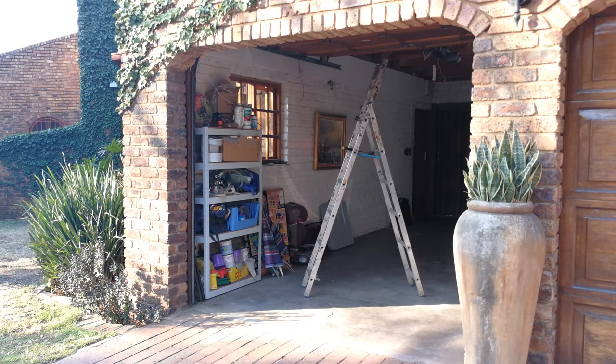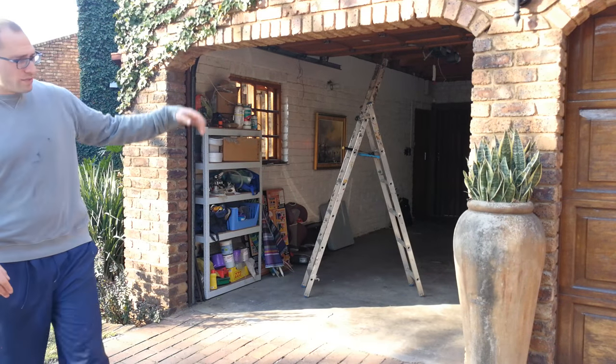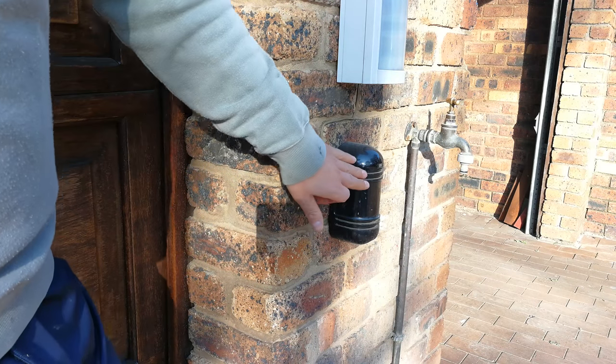In this installation you can see a garage door. Most garage doors are not safe - they don't have safety beams - and that's why it's a good idea to add them. I do have a video explaining how to connect the safety beams. You effectively place one safety beam on each side wired to the garage door controller, and then if there's a car in the way, a child running out, or any obstruction, the door will not close onto it. That's the purpose of the safety beam.